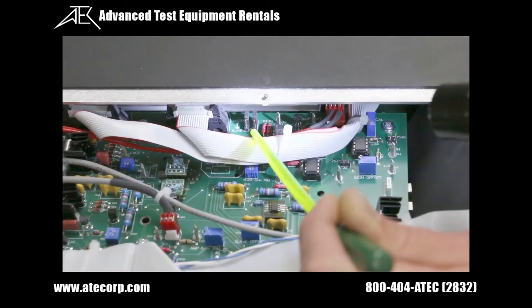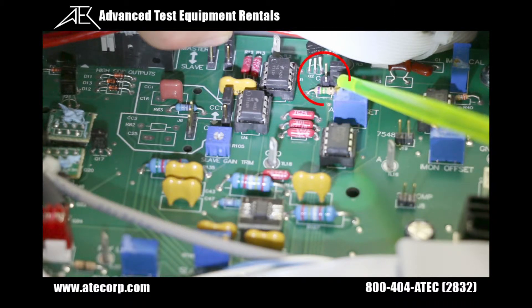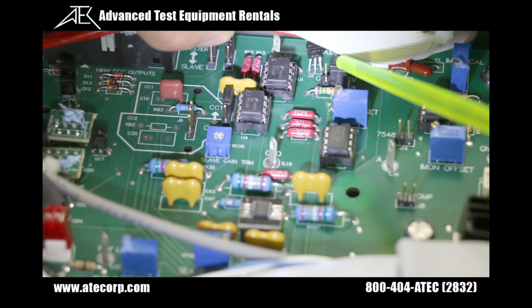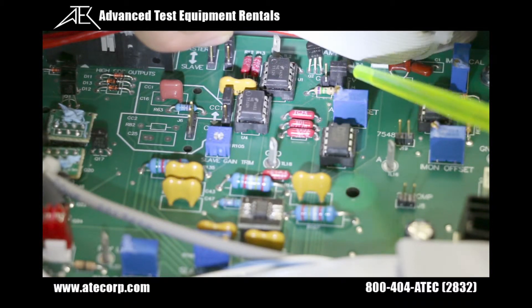Now I'll show you how to configure the 7224 as a single amplifier or as the master in a master-slave configuration. First locate jumpers P1 and P2 towards the back right of the card and set them both to the master position. Conversely set both pins to slave for use as a slave amplifier. You also have the option of configuring the amp to operate as either a voltage amplifier — a voltage controlled voltage source — or as a transconductance amplifier, which is a voltage controlled current source. This selection is made by jumper J4 located to the right of the master-slave pins. The unit is set by default to controlled voltage. Please ensure that if you operate the amp in current controlled mode that a load is always connected before you turn the amp on. In an open circuit, creating current flow is impossible and the current source will increase its voltage until it reaches the voltage limit of the unit, which is dangerous for both the amp and the technician using it.